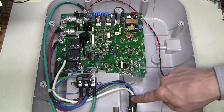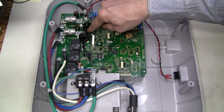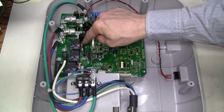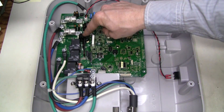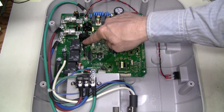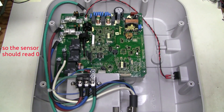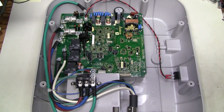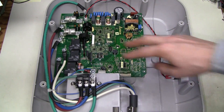This current transformer is measuring current flowing through one wire, so this must be a current sensor. And this one is measuring current flowing through both wires at the same time, so this must be a GFCI — a ground fault interrupter. In normal circumstances the same current should flow through both wires but in opposite directions. But if there is a problem — say, insulation is broken and part of the current does not come back — there should be some imbalance. And once that imbalance reaches some threshold sensed by this current sensor, the protection should kick in and disconnect the output.